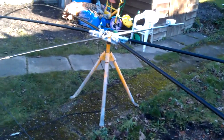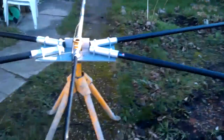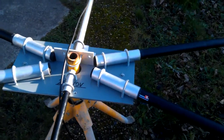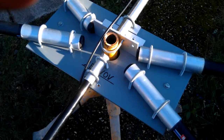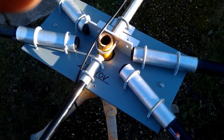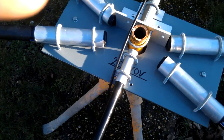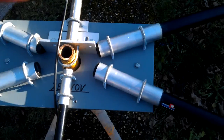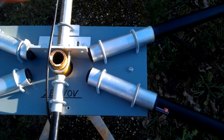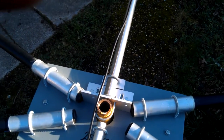It's working in very nice broadband performance wise. Very impressed so far. We haven't had a chance to do an A-B test of comparison other than running up and down the garden with a radio tuning into the same station. Initially it looks like it's doing better than the cobweb over an S point comfortably and there's absolutely no noise. The cobweb is no slouch when it comes to omnidirectional, so obviously this is showing its mark between an S1 and S2. More on that sometime, but it's hard to tell for definite.